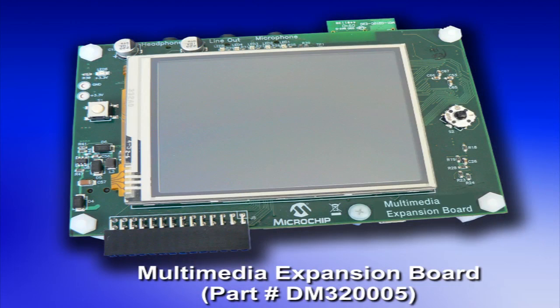With all these capabilities, they're applicable to a wide range of applications. It supports motor control — it can do two three-phase motors, like a compressor and a fan at variable speed. It fully integrates with our graphics display technology and our multimedia expansion board, so you can do graphical displays, m-touch capacitive touch human interfaces, MP3 decode for very good audio, and also acoustic echo cancellation for things like hands-free car kits. So it covers audio applications, graphics, and motor control.